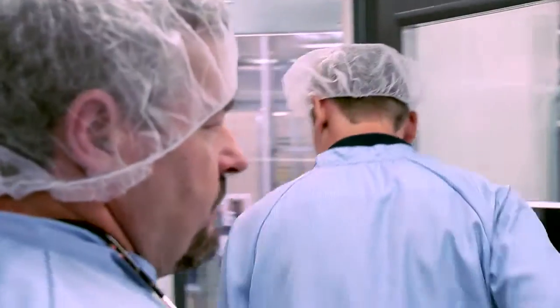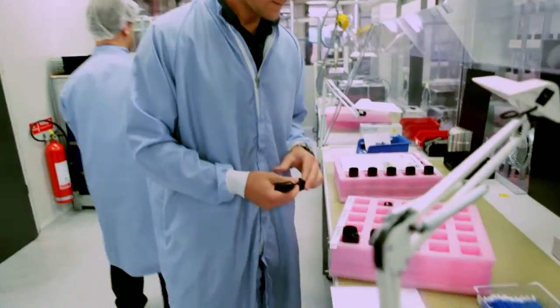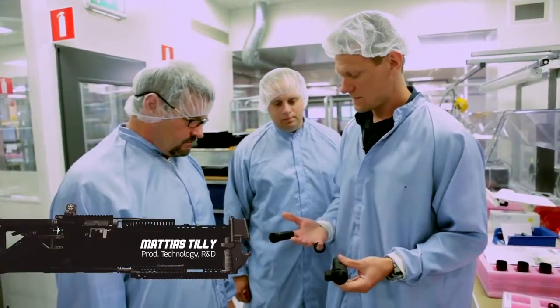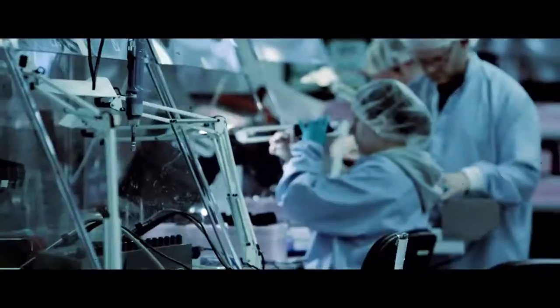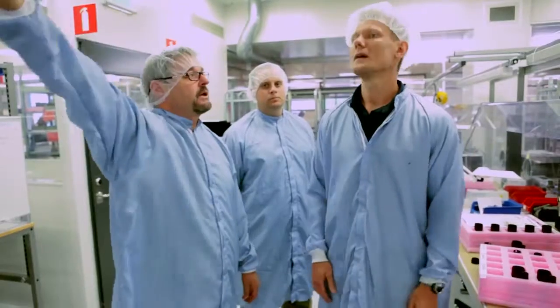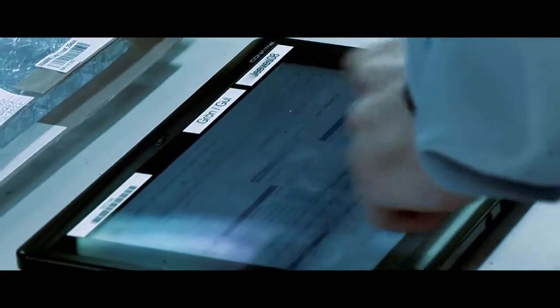He's in the process of bringing parts from where they're taken out of inventory, cleaned and sanitized, and then brought through into the clean room, and we're ready to start our process of assembling a sight. To begin with, we have three big parts: the inner tube, the house, and the rear tube. They're built individually on this little island, and then we have four assembly lines. We can build a Comp M4, we can build a micro. Every detail has its own barcode and is registered — if we receive the sight back, you can pull the serial number and see which date it went through receiving inspection protocol. So fully traceable.